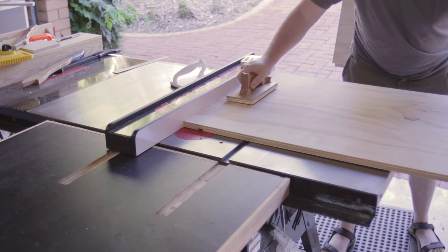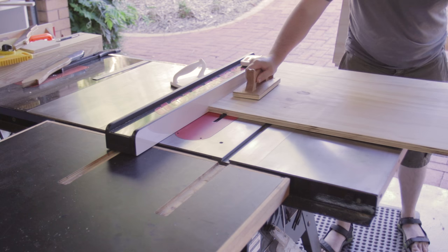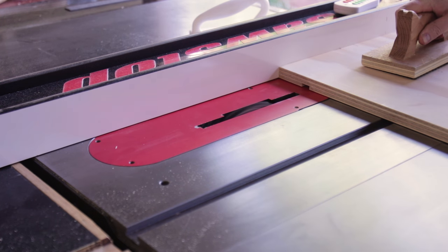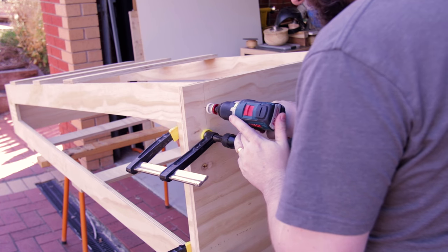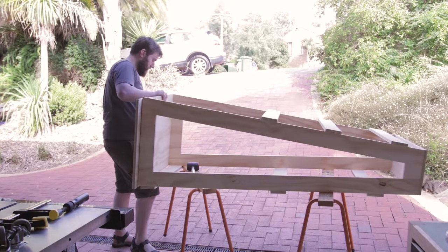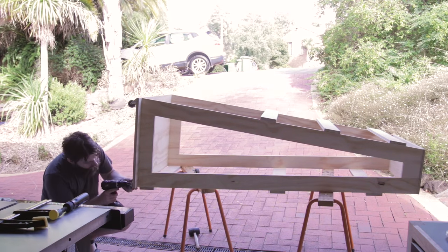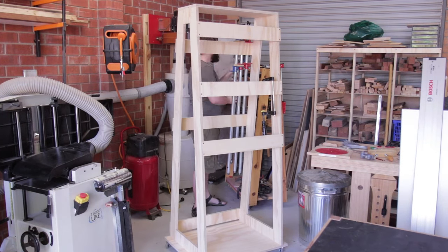The base of the cart received two dados that the uprights will slot into. Then it was just a matter of fitting the rack into the dados, drilling some holes for screws, undoing it all to add glue, then using the screws as clamps. While it was on its side I added some casters — these are small 50mm casters and I'll be replacing them with the same type I used on my sharpening station; these just happened to be what I had on hand. While the glue was still wet, I flipped it up and sat it loading on clamps.